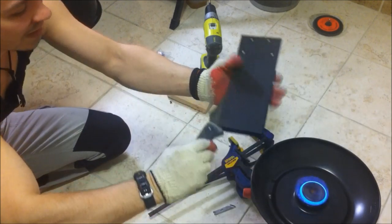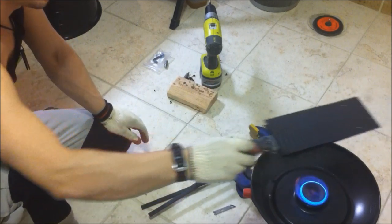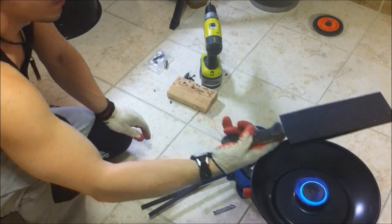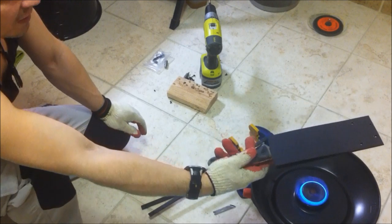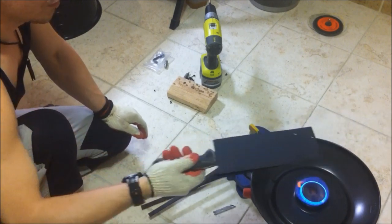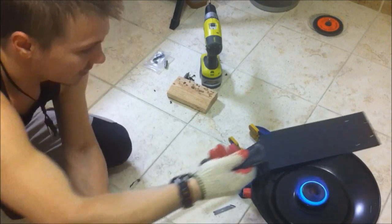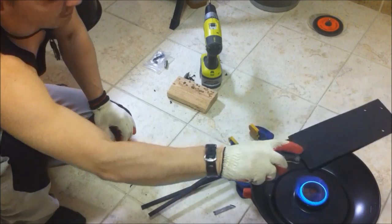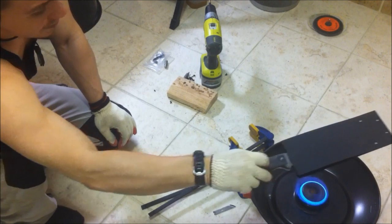This works just perfect for me. Ventilate the room and be careful with the fire. When I started I was doing it in the regular kitchen oven. You just take your time, don't get it too close to the fire so it doesn't burn, keep spinning it, heat it up evenly, and in a couple of minutes you get the Kydex nice and soft. You position your blade the way you want in the press, and close it as tight as you can get it.